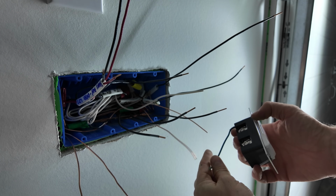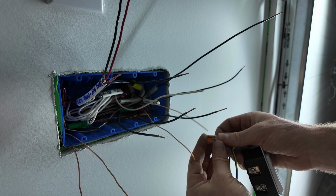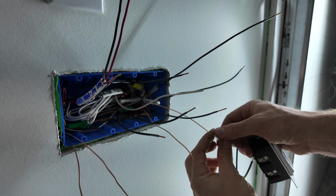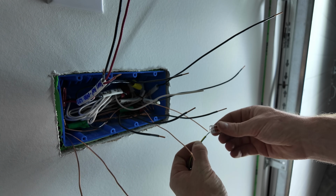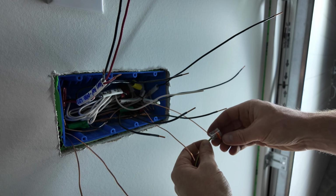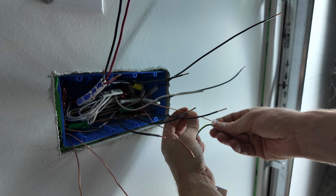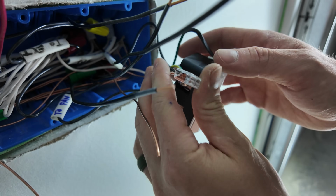This switch has a stranded ground wire, and that is a situation that I'm gonna always use a Wago in. Aside from when I'm trying to save space, these things are great for stranded to solid connections. Pretty much all of our light fixtures have the same situation where there's a stranded conductor that needs to be connected to a solid. I find these work better than wire nuts for that. Holy smokes, 1 down, 3 to go.